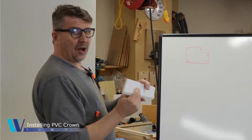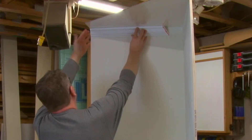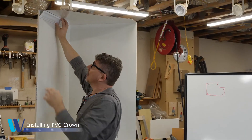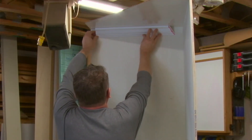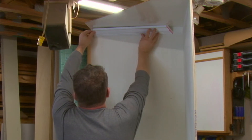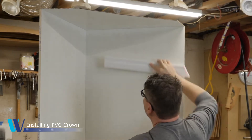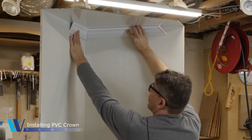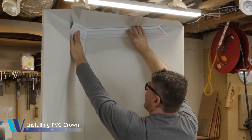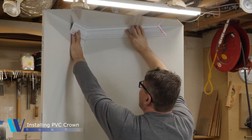The other thing about installing crown molding is that projection angle. Inevitably, if you try to install it just working off the two feet that rest against the wall and the ceiling, as you work along you're either going to push it up on the ceiling or let it fall down on the wall. What happens then is when you get to the area where you're trying to put it together, you'll end up with something that looks like this — and it's extremely frustrating. The only way to correct it is to remove that piece and readjust it.